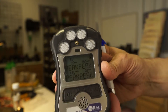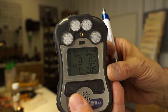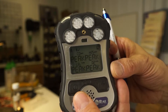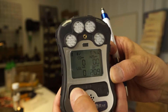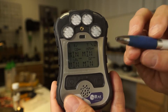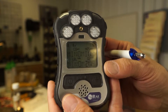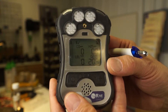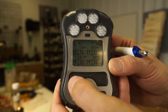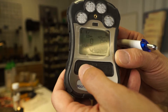On the instrument itself, you can hit the on-off key and it shows you the peaks. Peaks are the highest reading that the sensors have seen since it's been turned on. Hit it again and you'll see your minimums. Minimums are basically for the oxygen — if we dropped this down into a pit and couldn't see the instrument, we heard it go off, you bring it back up, the conditions come back to normal. You can hit the mode key and navigate to this minimum screen to see how low it went.